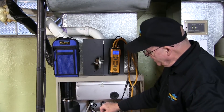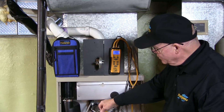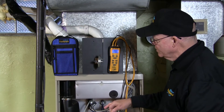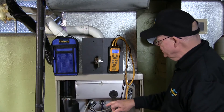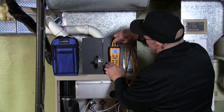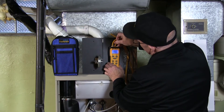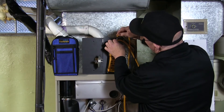I went ahead and hooked up my test leads to the normally open and the common. If you were to test a pressure switch without the external bleed port and it's a very low rating, it may be very hard to obtain the readings that you need. So I'm going to go ahead and plug this onto the pump port of the SDMN6.